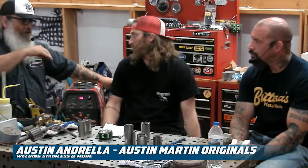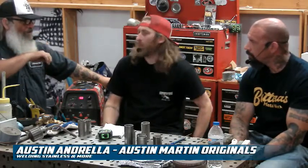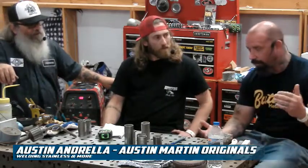You're looking to maintain a certain heat because that gives you your tracking and penetration. For example, as the weld progresses, say 4, 5, 6 inches, you're building heat that entire time. So you can adjust your amperage with your foot pedal by coming off to make up for all that heat that's built up along the process of how much time it took to make the weld.